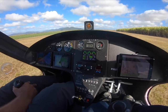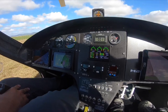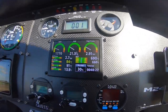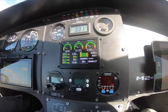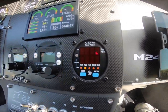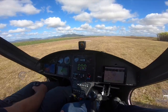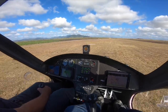So what gyro is this again? A Magni M24, 915 — so 140, 141 horsepower — and the turbo, they've got that Canardy system. The only thing I don't like is it doesn't have fuel flow, so I added the FS 450 fuel flow meter at the bottom there, the red one. That's now linked to this thing and it says we are flying to Turtle Park. Current flow is 2 liters per hour taxiing, 3 liters, and as we take off it'll go to 40 and then coming back it goes to about 22-23.